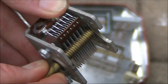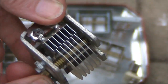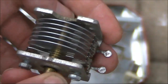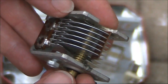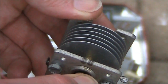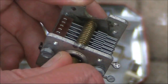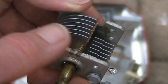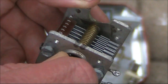This is something you might find at a ham fest. It's wider spaced than the normal variable capacitor you might find in a valve radio. I'd estimate its maximum value is around 50 or 100 picofarads, with a minimum value of around 5 or 10. The frame is connected to the rotor and the stator plates are insulated from the frame. Minimum capacitance is when the plates are not overlapping; maximum capacitance is when they are fully overlapping. Because these plates are semi-circular with no cutouts, a setting at 50% is exactly 50% of the maximum value.